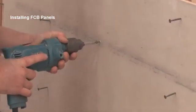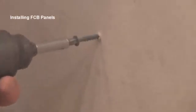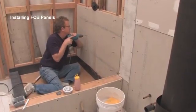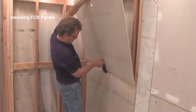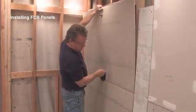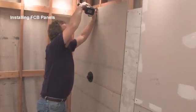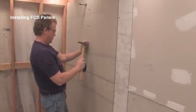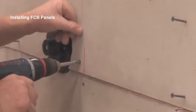It's very important to install the right screws. Inch-and-a-quarter long screws are used to attach quarter-inch boards only. Half-inch boards require one-and-five-eighths inch, and longer if the boards are spaced off the studs. Regular or galvanized bugle head screws appropriate for gypsum drywall are the wrong choice, since they are not self-countersinking and not strong enough to dimple FCBs, nor do they have the required holding power.